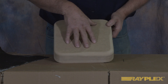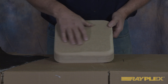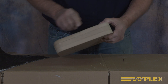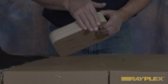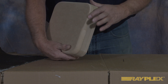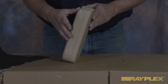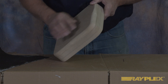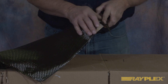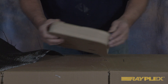Here we have a piece of MDF. We're going to put a black surface coat on so that the color doesn't show through in the carbon fiber. I'm also going to show you how, using sharp edges, it can be difficult to get around the corner. So if you're making a project, you want to make sure that your edges — if they're sharp, you're going to have a lot of difficulty. But if they're nice and rounded, they're going to be quite easy to get around, as you'll see when we get into laminating with carbon fiber.